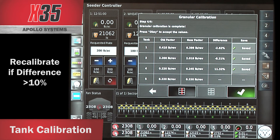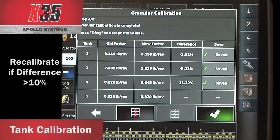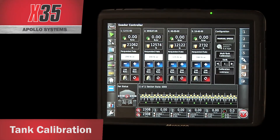If you're out by more than 10% from your last calibration, there's a chance a mistake was made. The different number in calibration takes into account different product densities, seed treatments, the cleanliness of the seed, and anything in the metering auger system. If you're out by more than 10%, it's recommended to redo that calibration to see if you get a better number. When you're done, hit the green checkbox and it takes you out of the multi-tank calibration wizard.